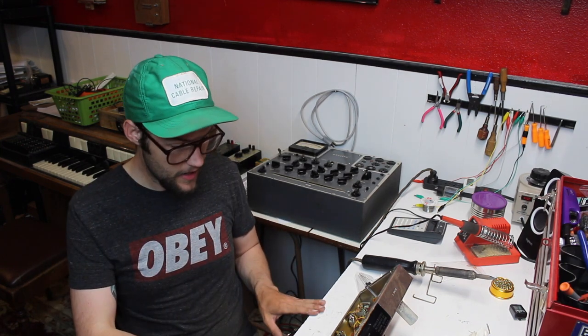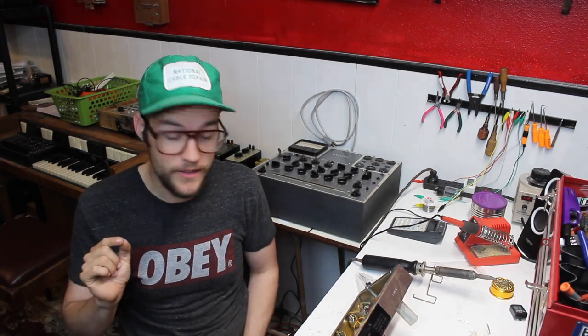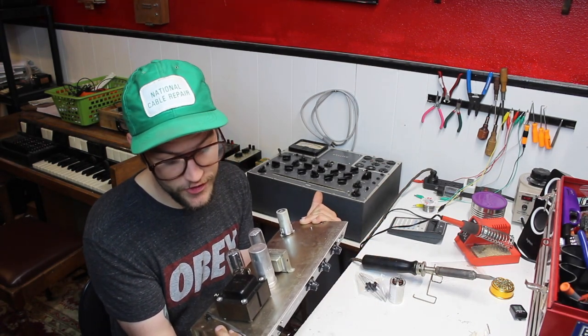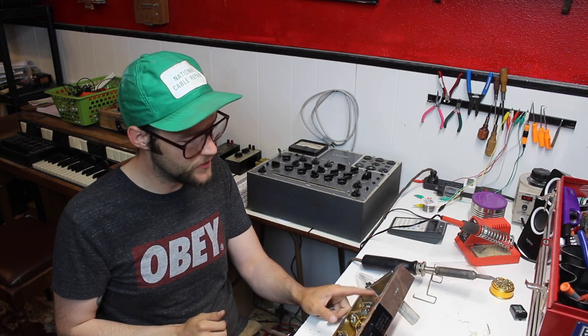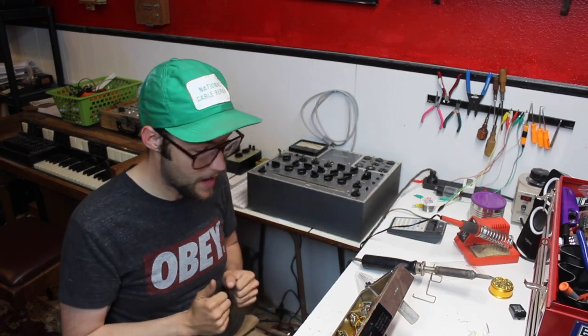Today, we have a recap restoration of a 1965 Fender Champ, a very early CBS. I'm looking at the date codes here, and we've got 13th week of 65. We got a combination of the post-CBS silver face brown turds right here, but we also have one molded cap, so this is very much a transitional amplifier.